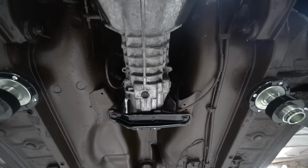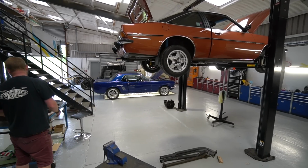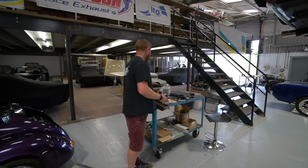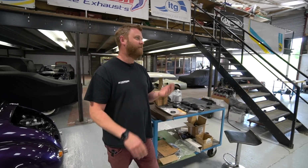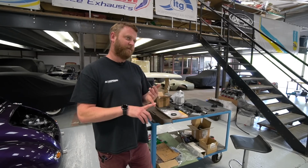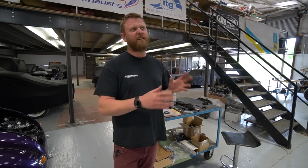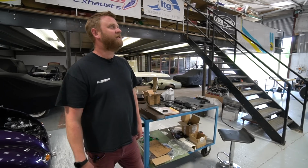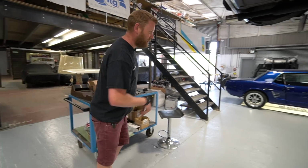And then most of the rest of it is standard parts, so it's a standard 5-speed prop shaft. Centre console, because they did a 5-speed, you can get the centre console with the gear stick hole in the right place. The customer's already supplied most of these parts, so the clutch was with it, clutch cable. I think the speedo cable's different, that's been supplied. So it's, apart from doing the transmission tunnel mod and the gearbox crossmember mod, a lot of it is essentially fairly straightforward mechanical bolting stuff together. So yeah, we'll hopefully progress very quickly with this and get that done and back with him in the next couple of weeks. Obviously now I've said that, I'll have cursed it and it will go terribly wrong.